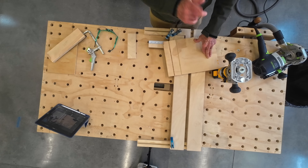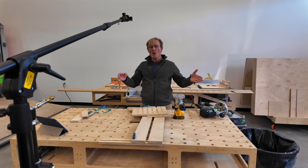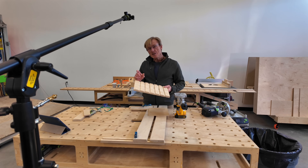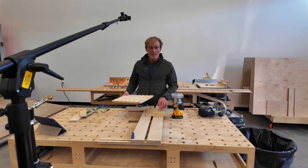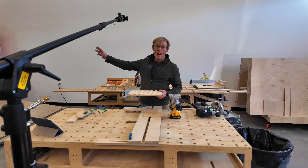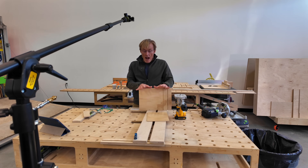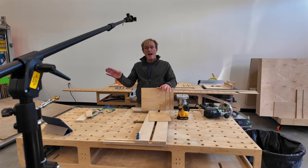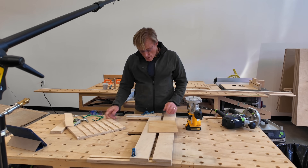But other than the thickness of material, the jig itself doesn't care which router you're using. In the smart wood shop, all of those cabinets — the sides are identical. There's no right, there's no left. The dados in those are an exact spacing, no matter how tall they are. With this setup, I can set up that spacing, make that first cut and just march it off and get every one of those sides cut with this jig, without having to make anything custom like I did in the video series seven years ago when I actually built those. That's actually the motivation for this jig — I wanted to come up with something that was highly productive, meets my needs to cut dados quickly and accurately in a myriad of situations, jobs, and demands. But I also want to be productive and do the repetitive stuff, which is why I added the stop.